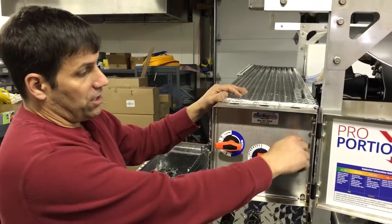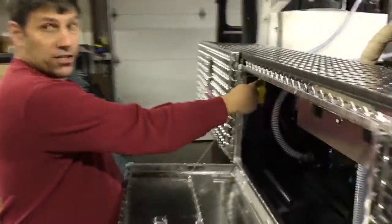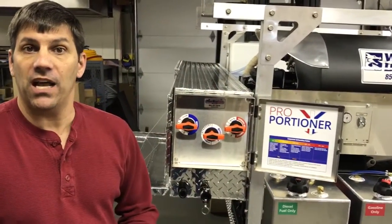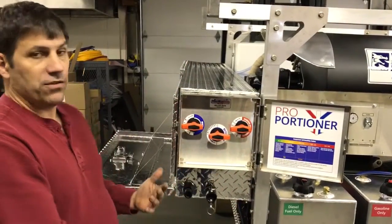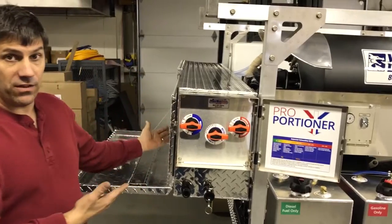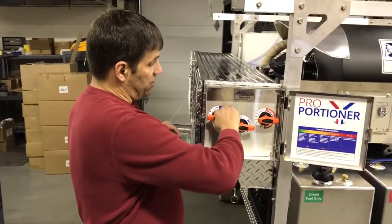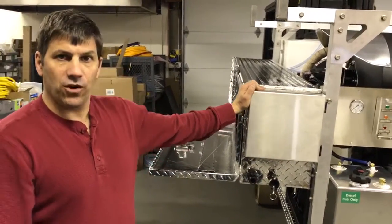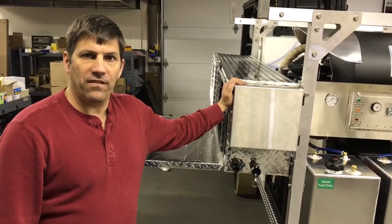At the end of the day, turn the detergent off, turn the SH valve all the way up, then switch the valve from SH to water, and spray — you can spray the remaining in the hose on the sidewalk as a bonus for the customer or finish spraying areas of the house. As you do that, the detergent and suds will disappear, confirming the system is flushed. Flush for a few minutes, then rinse — this saves the life of your pumps, hose reel, and proportioner. Shut everything off, close the door, and you're all set. This is how the Monster Wash short-bed Water Dragon skid works with the slimline hot water pressure washer. Paul from PowerWashStore.com, 855-351-9274.